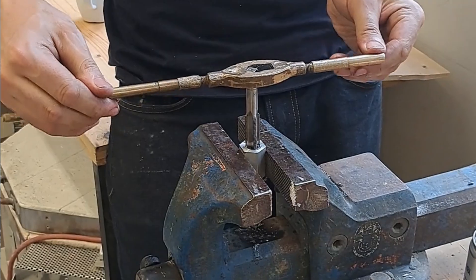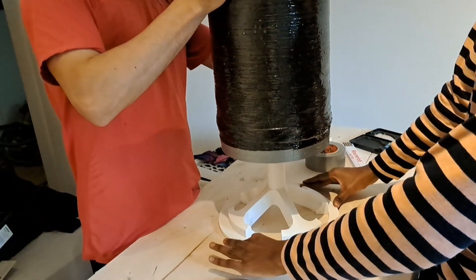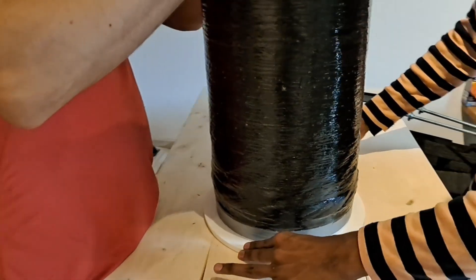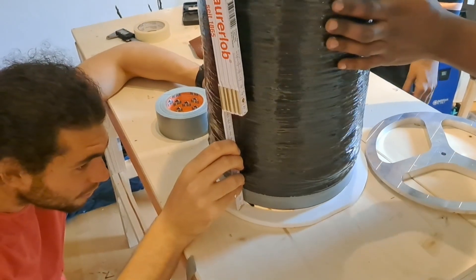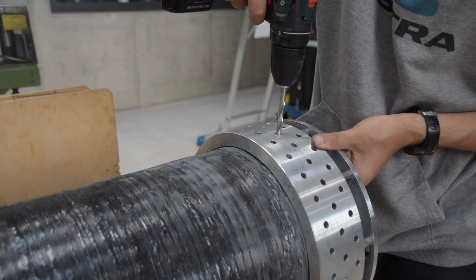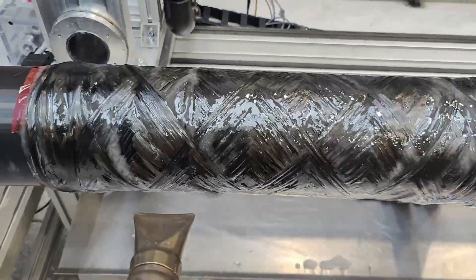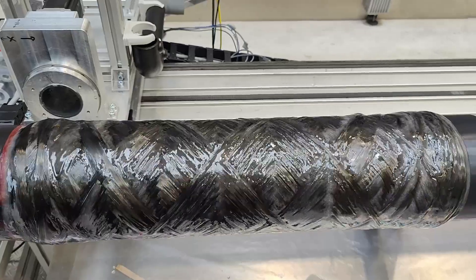There's an extra benefit related to precision. If you wanted to drill holes into a carbon fiber tube to match exactly with the holes in machined bulkheads, you'd have difficulty with integration. You'd need to design a whole rig to get everything precisely aligned, and the finished carbon fiber is not a perfectly smooth surface — so fitting contraptions onto the ends to precisely guide hole placement can sometimes be imprecise.